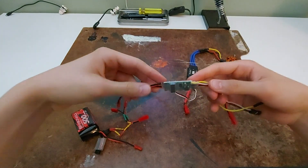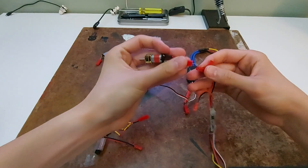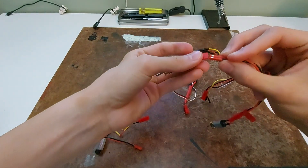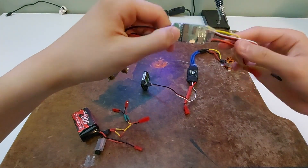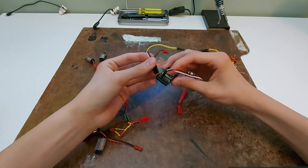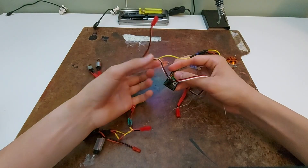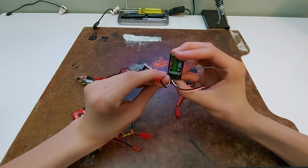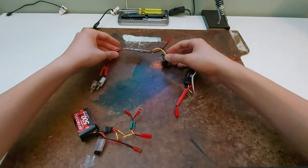I'm going to move on to my brushed motors and ESC. The ESC can control both motors, and I just have tape to indicate which motor goes where, just so that in the future everything spins in the correct direction, and channel 1 is in the right spot. The ESC connects to the receiver — this bunch of 3 connects to channel 2, making sure that signal wire is not in the place of the negative wire. And this lone wire connects to the signal on channel 1. Because the ESC is connected to two signals, it can control those motors independently.